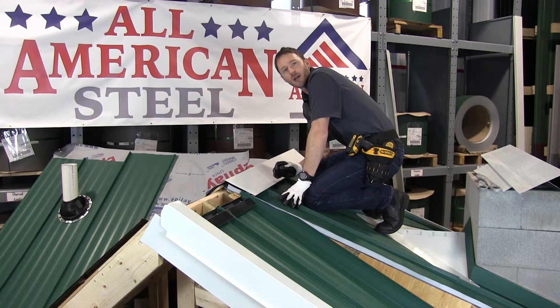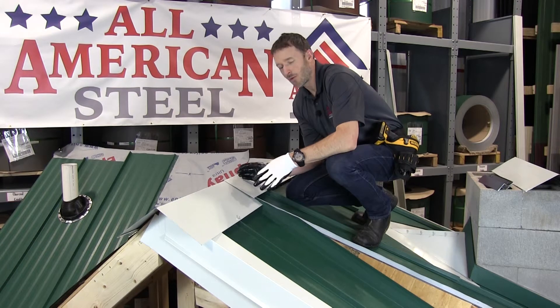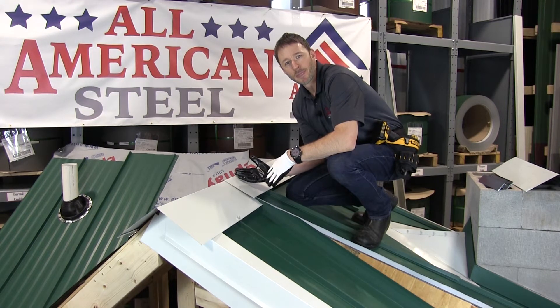There you have the two types of closed ridge cap installation: foam closure and metallic Z. Clearly, the metallic Z installation is the preferred method. Obviously it takes a lot more time, but it is absolutely the longer lasting preferred method. When overlapping your ridge caps, take into consideration the prevailing winds and have your join away from the prevailing wind. You want a six inch overlap with two rows of sealant in between, and mechanically bring them together using stitch screws.